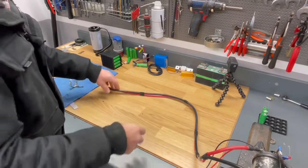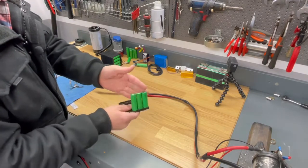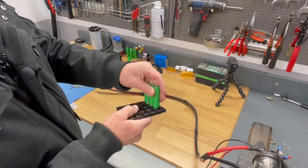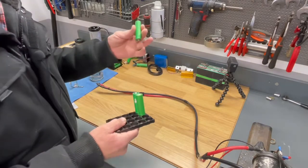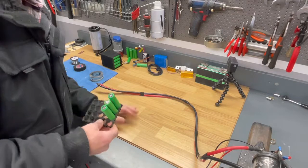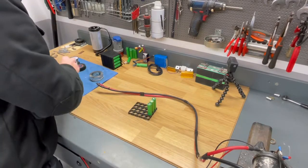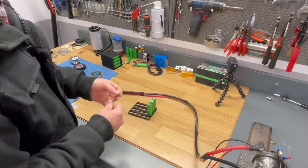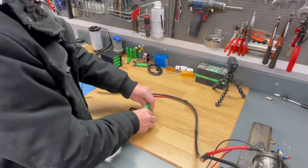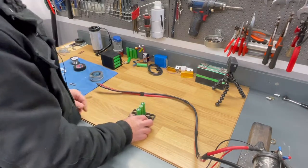So I will try to show you how it works. Here I have three 18650 cells and these are used cells so I have to clean them pretty good before I do some welding on this one. If there is any rust or anything like that, of course you have to remove that — if not the spot welding will be very very bad. I am going to use this kind of strip here. Let me put them in the middle here, just like that.